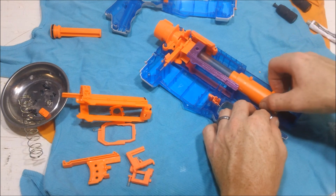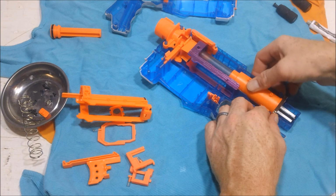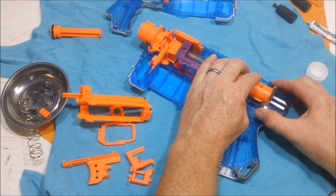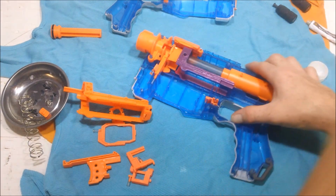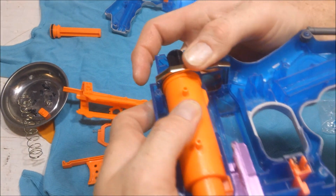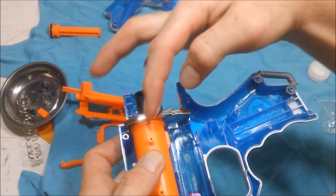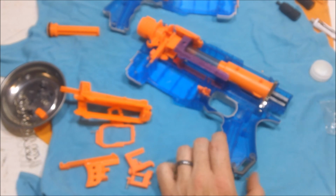Now those bumpers, I have not used those Worker bumpers before. They will actually allow the plunger tube to go in place without interfering with the catch. That was a concern of mine. I'm actually going to take a quick look here. Okay, that's some tight tolerances, but it works. The Worker metal catch actually rides over the top of the plunger tube just fine, because those bumpers do move the plunger tube back just a little, and I was worried about that.